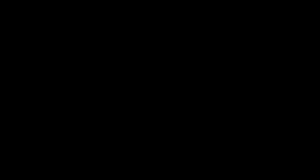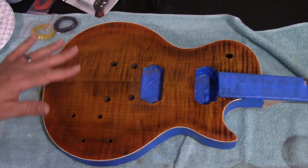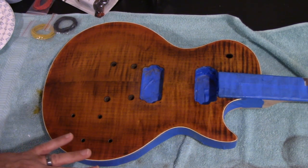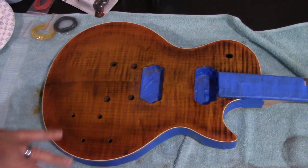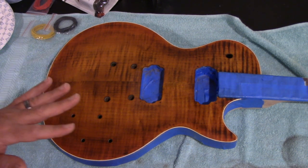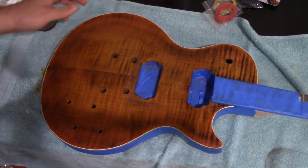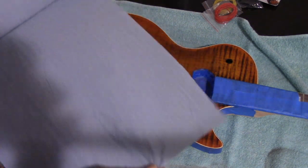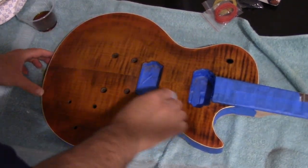This is the next layer — I put a pretty thick layer of True Oil and then buffed it with 0000 steel wool. It's kind of dull now but I'm starting to build up a nice thick layer. I'll probably do that three or four more times because I really want a nice protective coat. Before I apply the oil I sand it, let it sit overnight, and then clean it up.